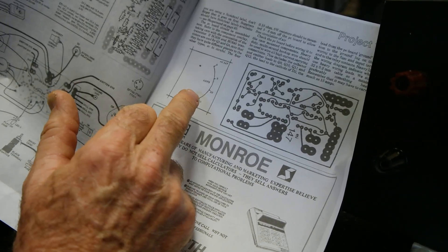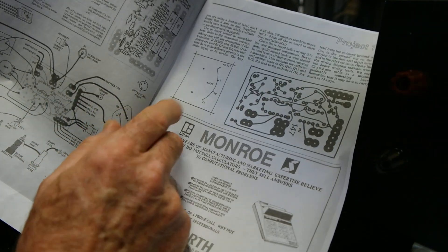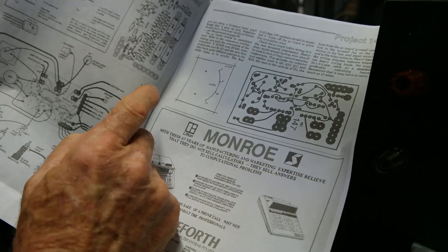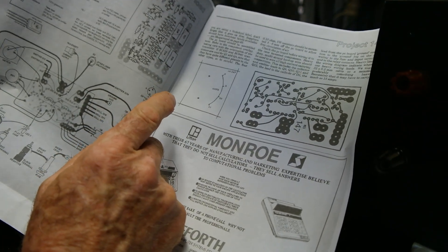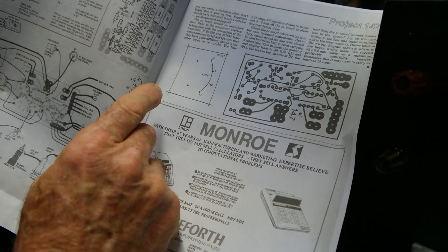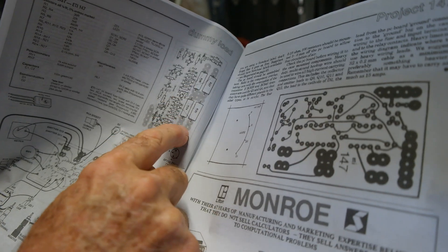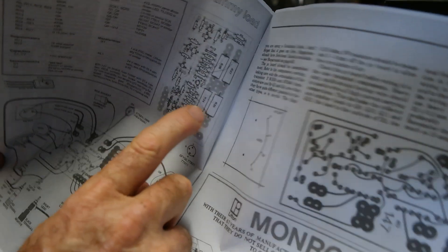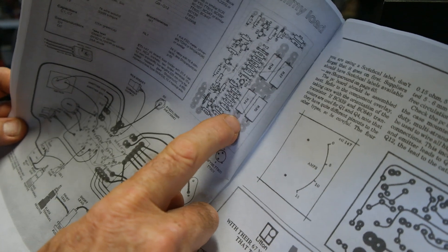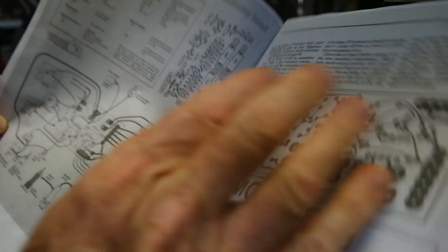The scanned magazine also includes the PCB layout and even the meter scale, because the original unit measured current across effectively a shunt made out of resistors — not the best way of doing it, but it kept the cost low. All the resistors were mounted on the PCB and they got stinking hot, which was a limitation on how far this unit could go.